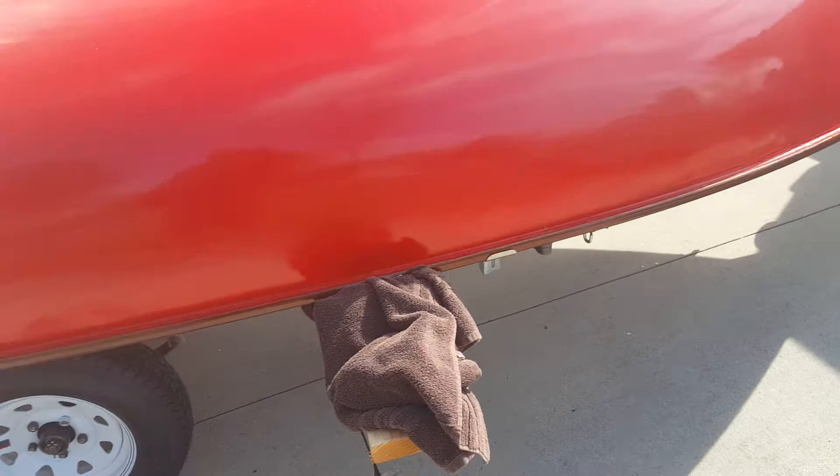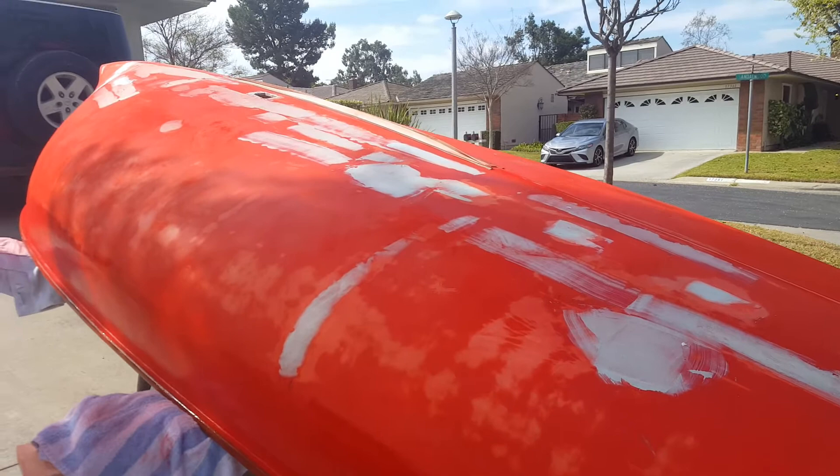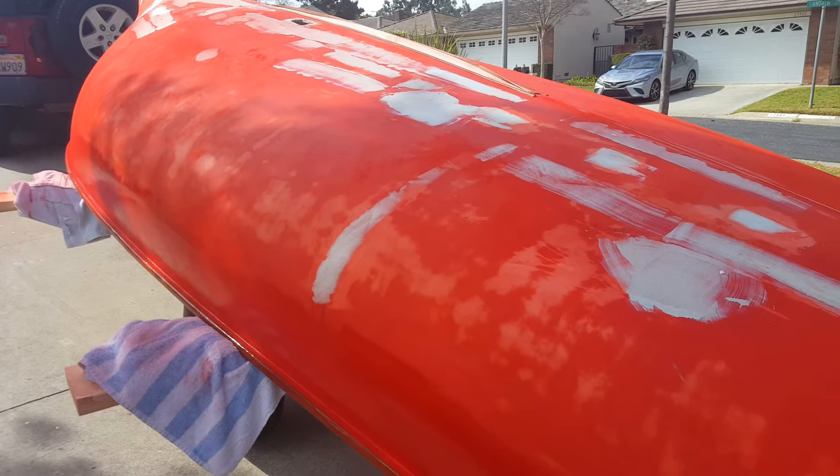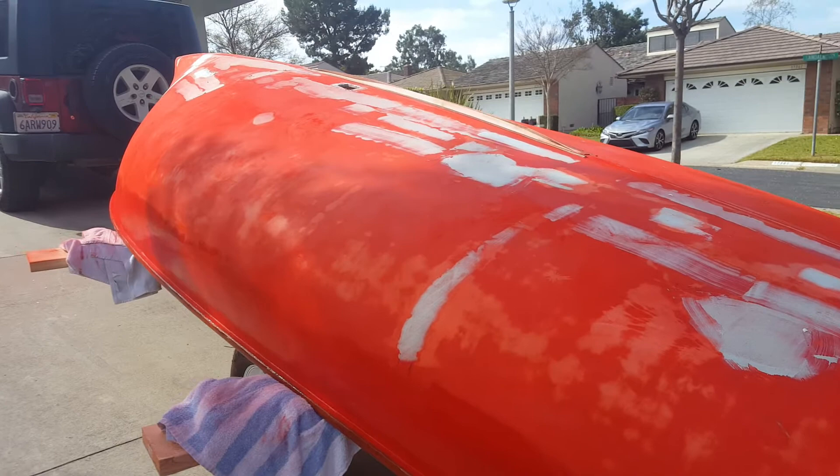When I'm done with that, the class rules allow a bead of thickened epoxy between the mahogany rail and the hull to give a little extra strength. So I'll sand that out, put a bead of epoxy there, and fair it again. The next video I shoot will be when I'm putting on some sandable primer I got from West Marine. I haven't decided which brand of paint to use yet — whether it'll be an epoxy or polyurethane. This boat stays out of the water and you do have to color sand it to make the hull as efficient as possible.